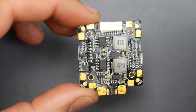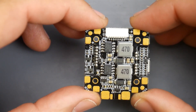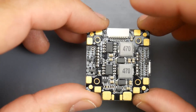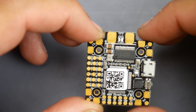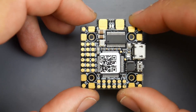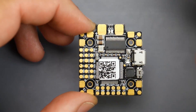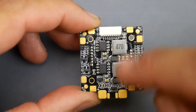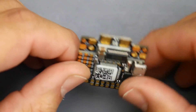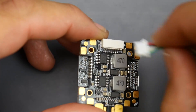I'm quite impressed that they've managed to place an 8-volt regulator. It has a 5-volt 3-amp and a 1.5-amp 8-volt regulator, and I think the DJI FPV system can connect right into this. The footprint is somewhat larger than other 20x20s, but I think it's the smallest 20x20 AIO footprint currently on the market. It has OSD, MPU6000, F4, even a barometer, and 8-volt and 5-volt proper switching regulators. There's also a connector if you wanted to use a 4-in-1 ESC, even though that would defeat the whole purpose of an all-in-one, but they've stayed flexible to meet everybody's demand.